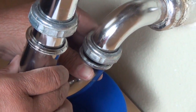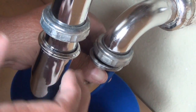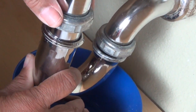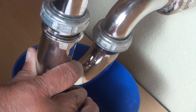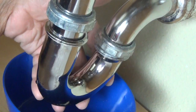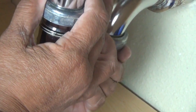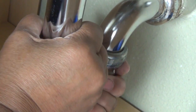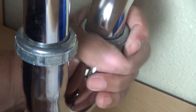What I mean by seat well is you don't want it tipped to one side or the other, because you certainly don't want to cross-thread. You just want it to be a nice, secure, tight connection. So I'm going to pull this down, make certain that everything is lined up — my back piece is lined up with my coupling nut, and my front piece is lined up. Now comes time to reattach our coupling nuts. I'm going to slide this down and tighten it by hand — that's really all you need. You don't want to over-tighten it. You just want it hand tight. And now we're going to do the back one — you just want it hand tight.